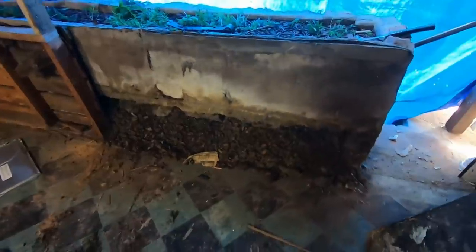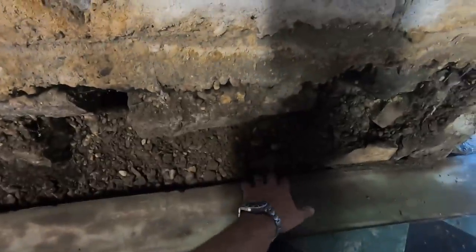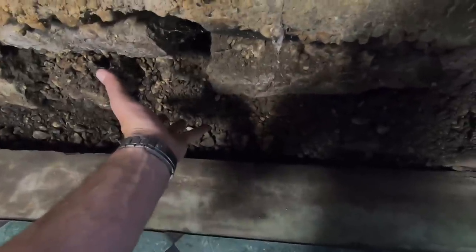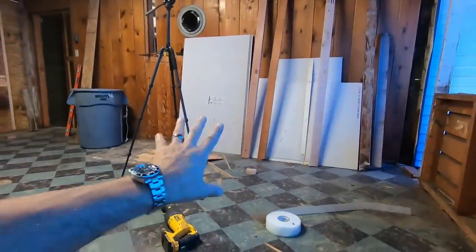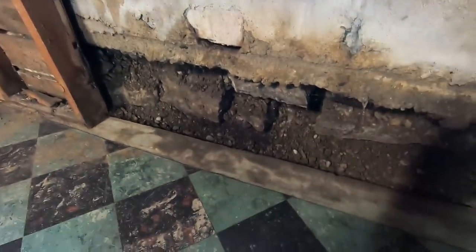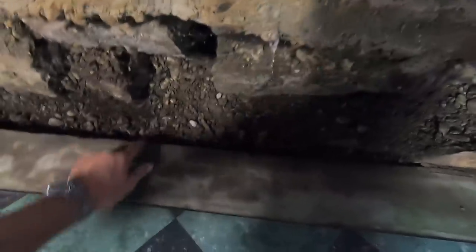I'm going to do some excavating and clean all that out to see what I find. What I'm thinking is we put some cement board as a barrier that goes down over this lip, keeping all that debris from falling in. The first layer of sheathing is going to be 36 inches of cement board — 100% waterproof, will never rot. Up 36 inches gets us well above grade. I may do a double layer: one layer going down over this lip so if stuff falls over the years, it just falls into that first layer of cement board.